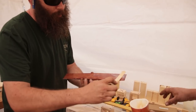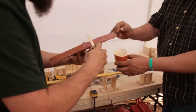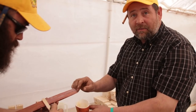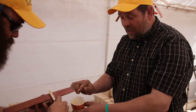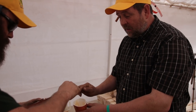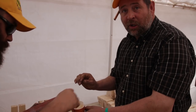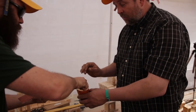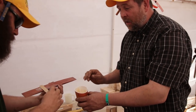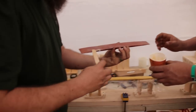When we set that power lam on there, after we get the glue on the bamboo, we'll put a little extra glue at the edges of that power lam, because you're going to have some type of void there. Even though we have sanded this down as paper thin as you can get it here at this edge, it's never thin enough. There's always going to be a little bit of gap there when you glue everything together. And you can see that on manufactured bows. There's going to be some there. So we always try to dribble a little bit of extra glue in that spot to make sure we have that cavity filled.